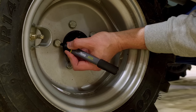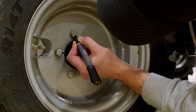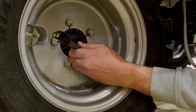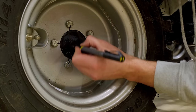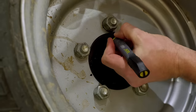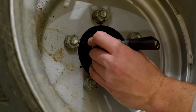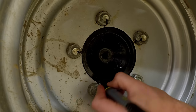So obviously checking the torque setting is a little bit more work — not something you need to do all the time. Because once you get the torque where it needs to be and you mark it, then it's just a quick visual walk around the machine to make sure nothing has changed and that your wheels aren't going to fall off. You may think it's not going to happen, but you hear stories about it happening, and that's about the last thing I want to experience, especially if I'm on a hill or some less-than-perfectly-flat scenario. That's just asking for a rollover or disaster.